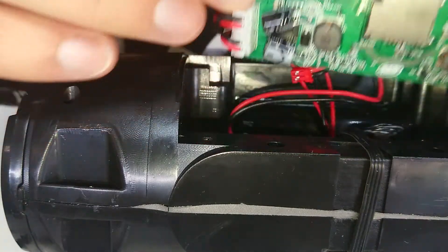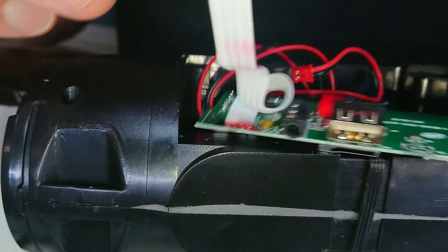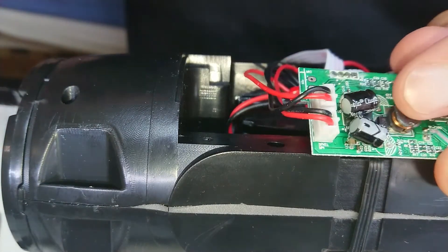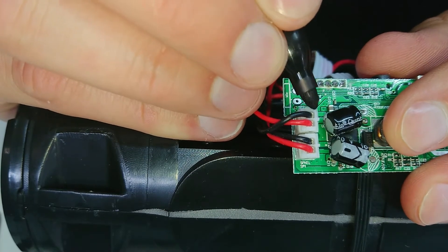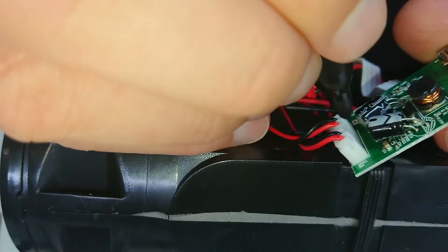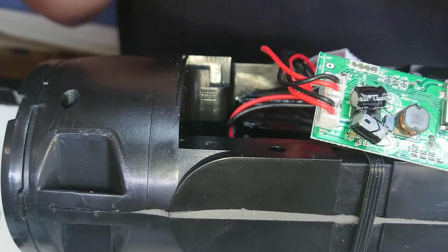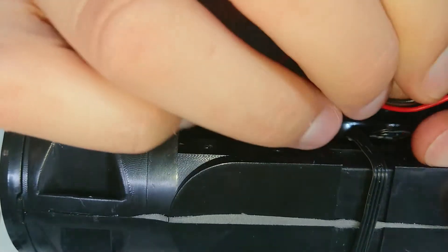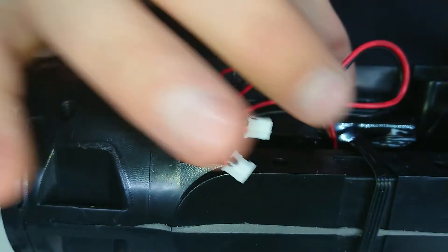In order to get this board out I'm going to have to unplug a few things. These contact strips just come out. These I think are the battery connections, so I'm going to mark them before I remove them — a bit of Sharpie on this side for that one, and a bit on the front, just so there's differentiation so it's obvious if I've got them backwards. It looks to be some fairly substantial batteries — definitely a pack full of 18650 cells.